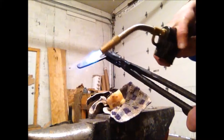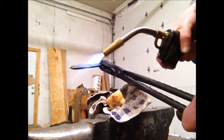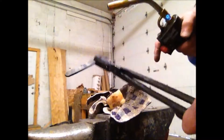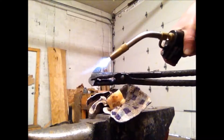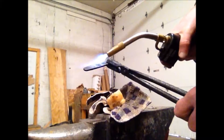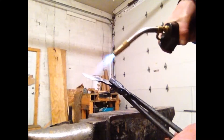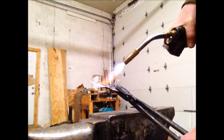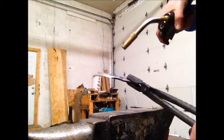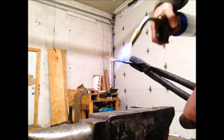So it's been hardened and it's very brittle. Now it's time to temper the knives — that's to heat them up again to a much lesser degree, which relieves some stress and some of that hardness, and instead gives you a tough finished product. The handle area is heated up to maybe 600 degrees to make it nice and tough. The blade area will be heated up to maybe around 400 degrees. You'll see that when I'm done touching it with the torch, it'll be kind of a yellow, brownish color — that's an indication of around 400 degrees, which will leave that blade nice and hard, but not nearly as brittle.